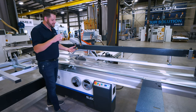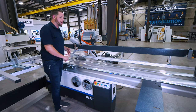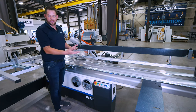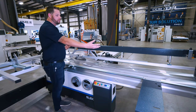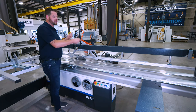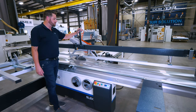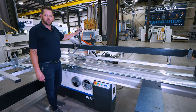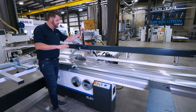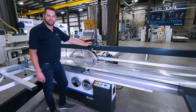Using this clamp, I can maintain operator safety, accuracy, and consistency over the life of the saw. I can also remove it if it's ever in the way — with simply two bolts at either end and a couple of guys, you can lift this up, mount it onto the saw, or demount it in about two to three minutes. An additional air pressure hose right here clamps right onto it with its own air supply. This is an excellent feature to have for both workpiece security and operator safety.